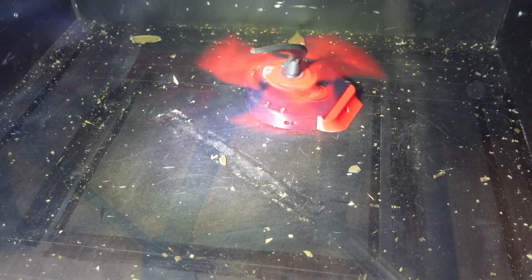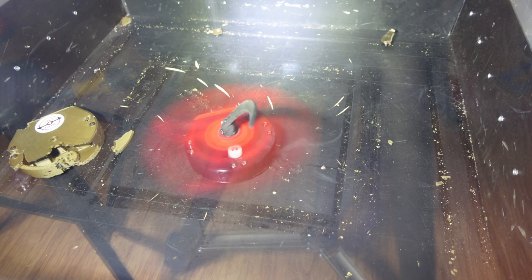And I found this cool-looking futuristic shuriken design. So naturally I pretty much copied the entire outline of it and then played around with it quite a bit to turn it into a usable weapon that is only a little bit lighter than the axe head weapon, but instead of being cut out of 3/16th inch AR500, it's cut out of 3 millimeter thick AR500. So it's a lot thinner, but it has the 9-inch effective reach that I want, and because it is symmetric as a 3-blade weapon, it is perfectly stable no matter what. No more flipping upside down. The axe head weapon has an MOI ratio from X to Y of about 3 to 1, whereas this tri-bladed weapon is essentially 1 to 1.